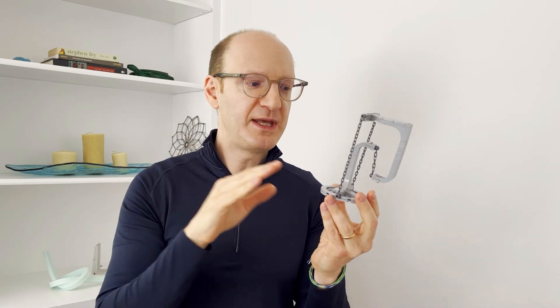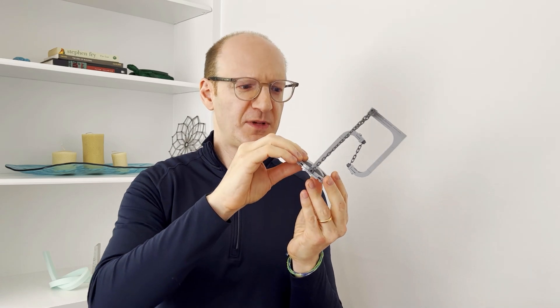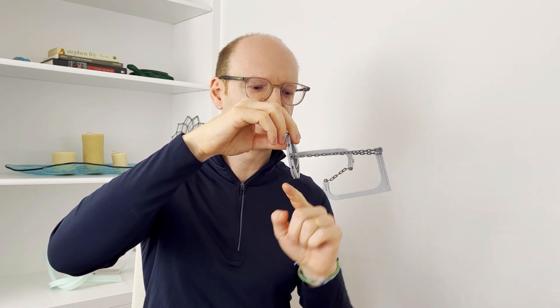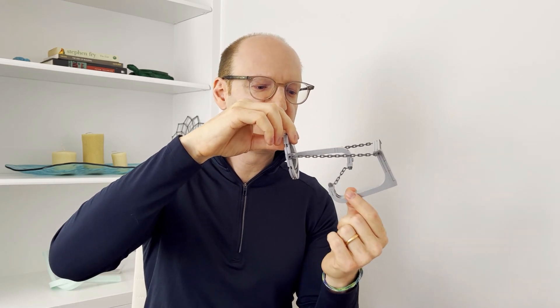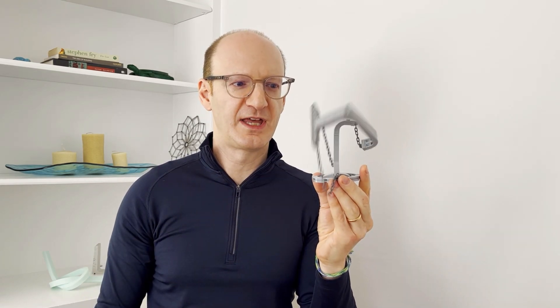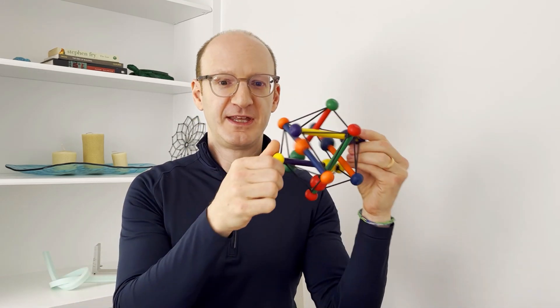But one of the key parts that is important to keep in your mind is the word balance. In many ways what this is doing is maintaining balance of the structure. It might be easier if I tip it this way to see that the weight of this piece, which wants to fall, is being held in tension through these tensile cable elements, and they're not allowed to rotate by this other shorter piece here. In fact it is a little less stable if I tip it over — and there you go.